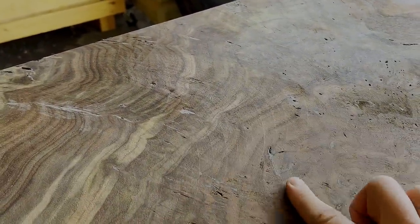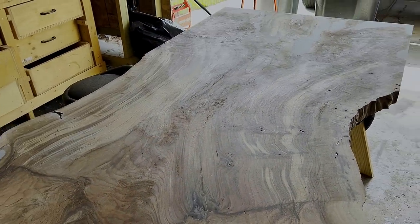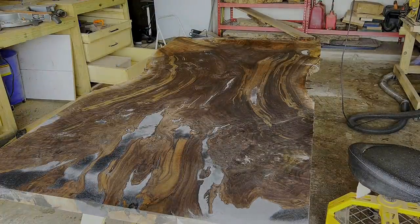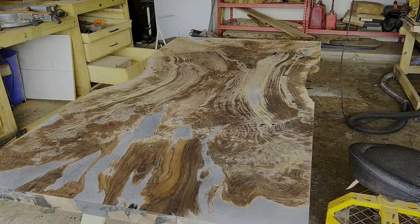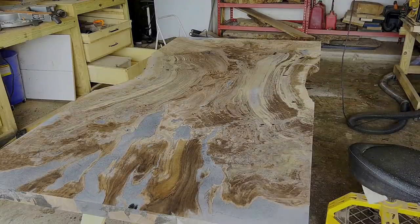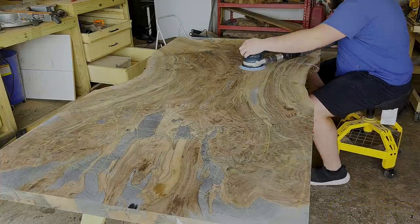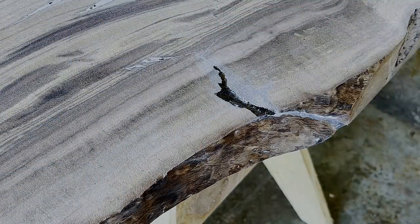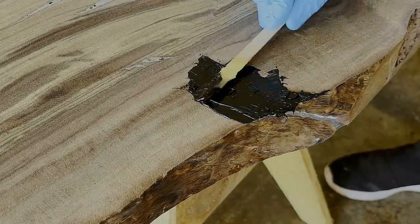This is the tear out I was talking about that occurs with the Lucas Mill - it's just part of it. I have seen and used water popping before, but at one point I was only using it because that's what other YouTubing woodworkers were doing. But here there's an actual physical reason: the Lucas Mill left those imprints and tear out, and water popping causes those loose wood fibers to stand up on end so when you sand them off, it gets rid of some of those marks. It did work for a bit, but at some point I just had to keep going over it with 80 grit until everything finally came out.